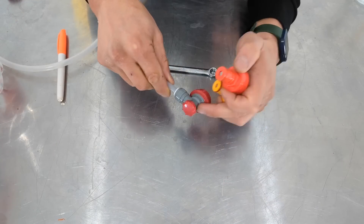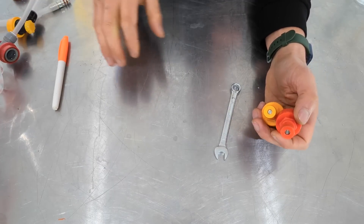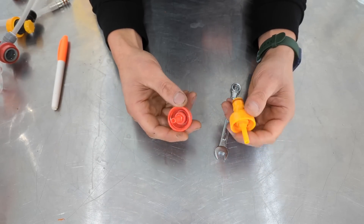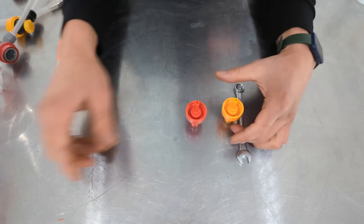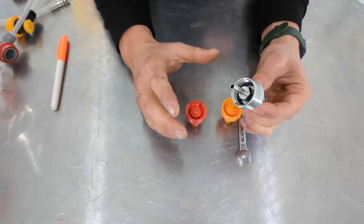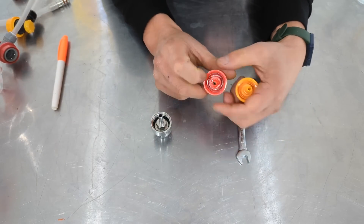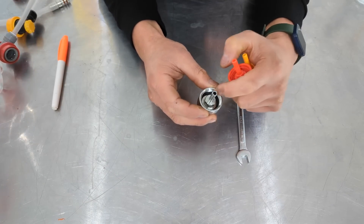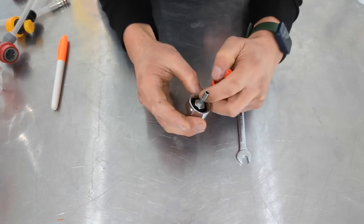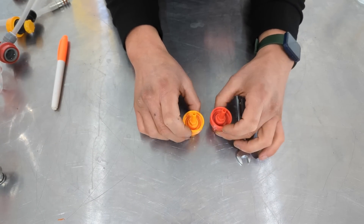The reason we didn't go with black and grey is because black and grey devices typically only go with each other, so we needed a new colour standard. Also, our logo and everything we make is red and yellow, so it was a natural choice. We do make stainless steel carbonation caps as well — they're fantastic for people who want stainless — but in my opinion the plastics work even better because they have a wedge seal, while the stainless steels use an o-ring. With an o-ring, if somebody twists too hard the o-ring can roll out of position, but with a wedge seal it's a far more reliable seal — it's a hard plastic sealing on the smooth neck of the PET bottle.